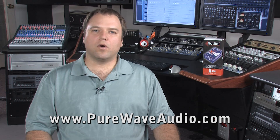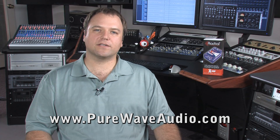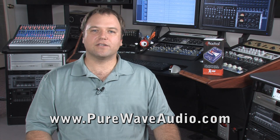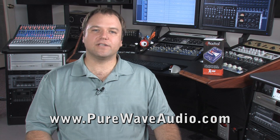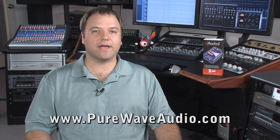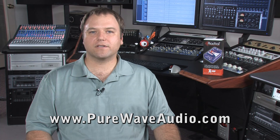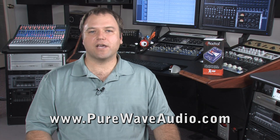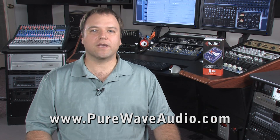Here are a few uses. One common beneficial application with engineers and producers is to send a previously recorded clean guitar signal back out into an amp and or effects processor to fine tune the sound and achieve a little extra magic for the overall mix. Many national artists play their parts and let the engineers spend hours dialing in sounds for their parts later, not via plug-in, but with real amplifiers. Playing the part once through their favorite amp while also sending a signal direct off the guitar via a direct box allows the recording engineer to take that separate DI channel and go back later to try all sorts of different amps and micing techniques to find that signature sound through the use of a reamp unit.